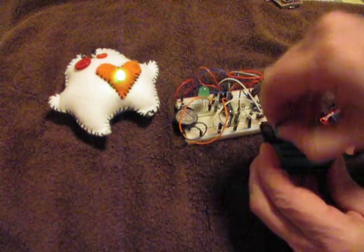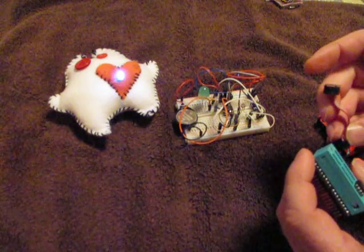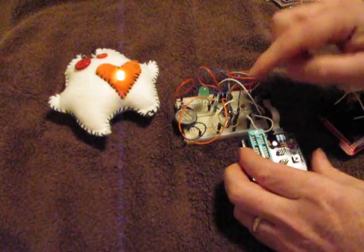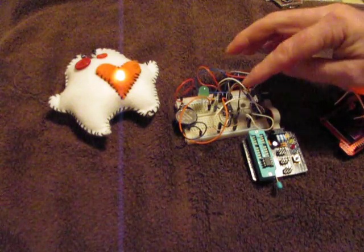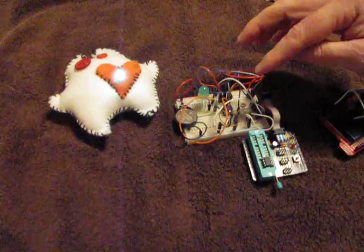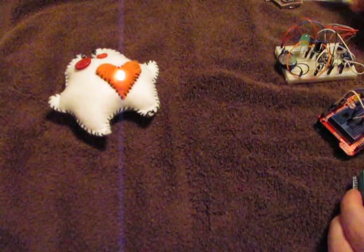In this case you can see I've got my board with an ISP header breakout on it, so you can actually just talk straight to the chip on the board. That's how we test the firmware on the ATtiny. We're actually using a 45 to save a few pennies, and once we get that ready to go it can go into our project.